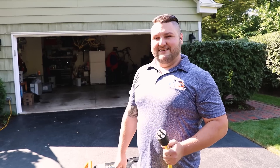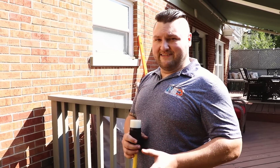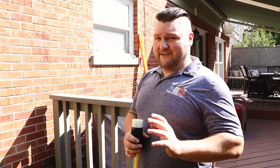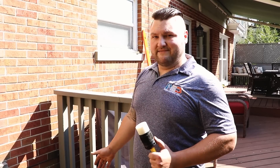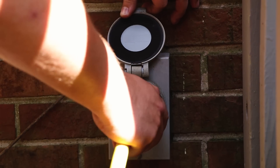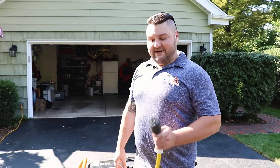For 240-volt items like a well pump, you're not going to be able to just plug into this generator — that's where a manual transfer switch comes in handy. When connecting to a manual transfer switch, you'll have an inlet box on the outside of the house and a cord going from that inlet to the generator. The number one thing to make sure is that a licensed electrician does this install — we do not recommend installing manual transfer switches yourself. On the outside of the home you'll have a NEMA 3R outdoor-rated inlet box where you plug the generator in. Start up the generator, plug the cord into the inlet box, and that feeds power from the generator into the manual transfer switch. Use your 30-amp twist-lock cord to connect into the generator.